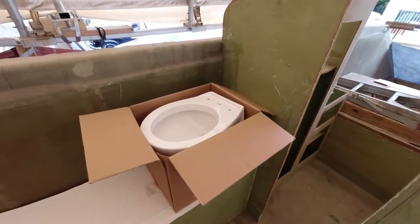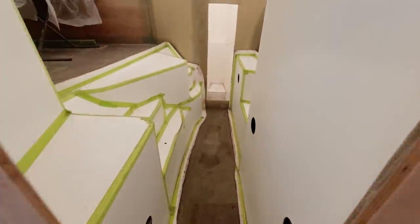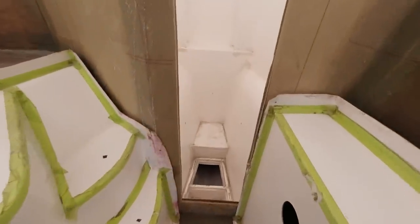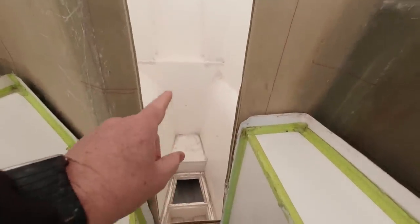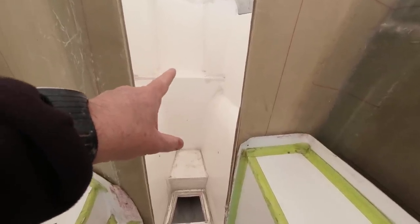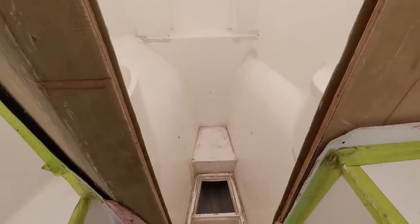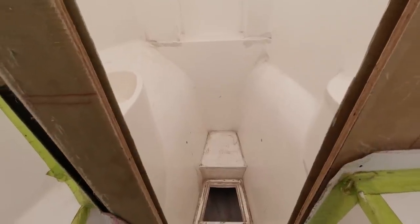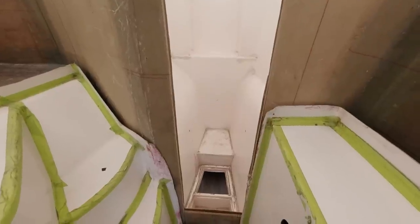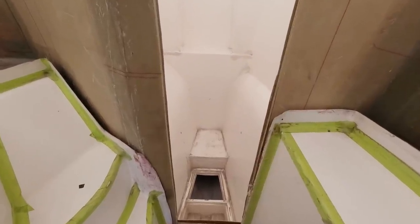All right, we've got the starboard head here now. This one's actually a straight-back unit and I've got to work out how I'm going to get the plumbing out of the back of it through this wall, up into a cavity above it — which has actually got a crash bulkhead behind it — so that I can have a three-way valve and an anti-siphon loop for the waste and for the return to the blackwater tank, behind a hatch. First thing I'm going to do is just place the toilet in place, outline it, cut a hole here so that I can have access to the crash bulkhead behind. Then I'm going to lift this head out and remount it later once I've done all this work behind it.